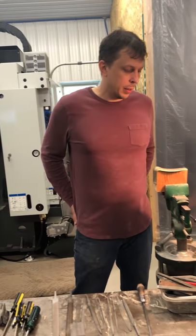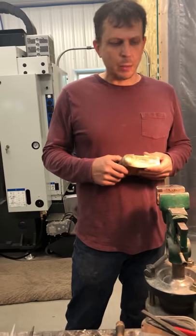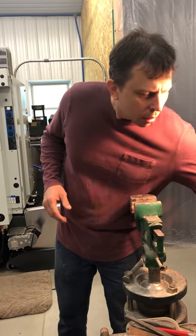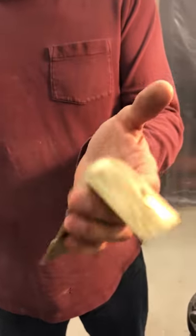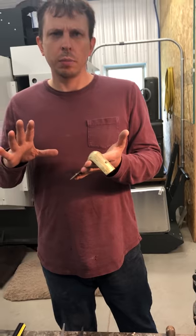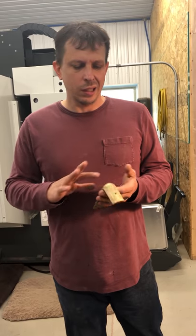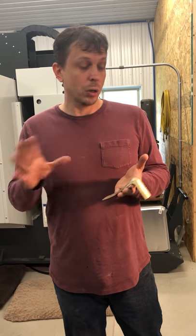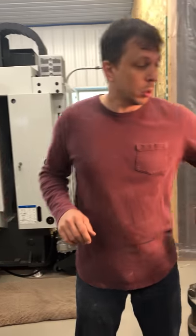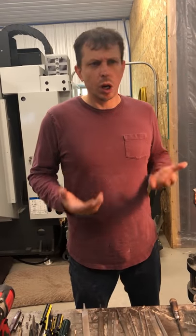And the first task we're going to work on is filing the butt plate. You have a couple options with the butt plate. Here's what the butt plate looks like, of course, as cast. And if you recall, we did all the assembly work prior to finishing any parts, and that is what I would definitely recommend. You don't want to polish any parts down and then assemble the rifle. You want to do it in the opposite order. Assemble the rifle, finish parts last. So in order to finish the parts, we have to file and then use some abrasive paper, stones, or a combination in order to get the surface much finer.